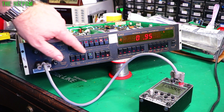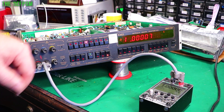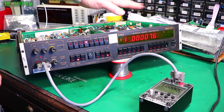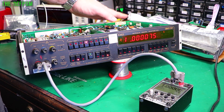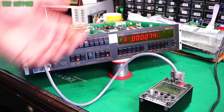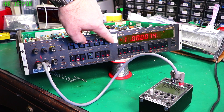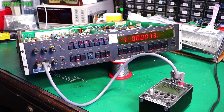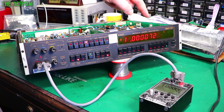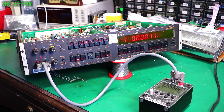If I put on one volt and go down to my volt scale, it's not looking too bad now. So the issue I had was it was very glitchy, very erratic - jumping all over the place, really noisy kind of readings. And all I actually did to solve this was go around and reseat all of the chips. So all the chips on this digital board have been reseated apart from the RAM, because if you reseat the RAM and cause a power loss, you can lose your calibration settings. I wanted to try and maintain the calibration this thing came with so I can use it as a comparison. It hasn't been calibrated since 2005 - so 15 and a half years hasn't been calibrated. So it's going to be a bit out, but it's just nice to know what it actually is. As you can see, it's now nice and stable - that's looking fine.